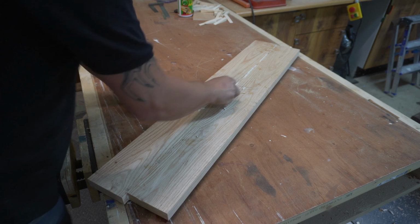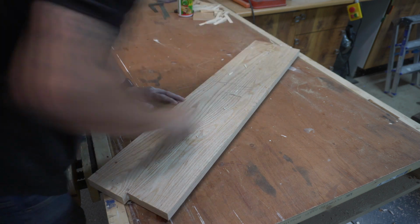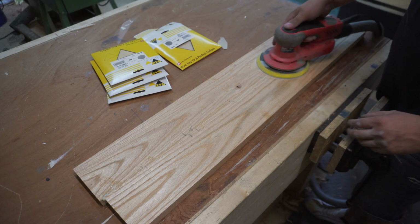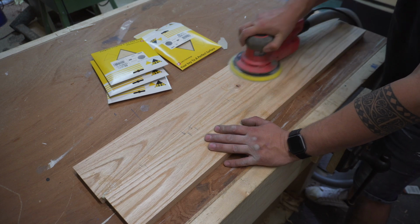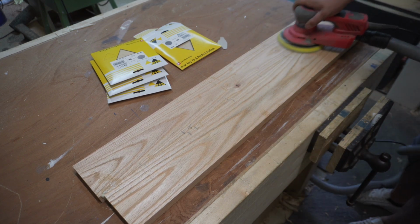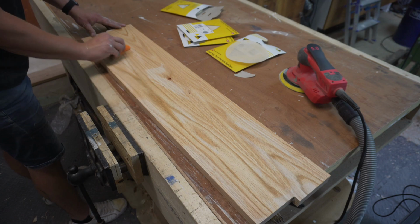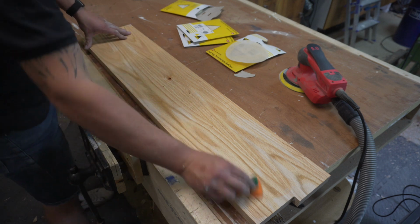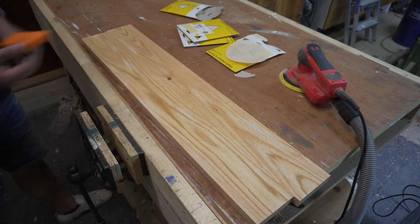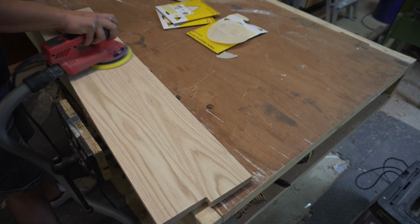Okay, so now we're out of the clamps, we can scrape the excess glue off. So we used a 5-minute polyurethane glue on this. I did wet one edge, but it still took about an hour to go off. I think they lie to you when they do this. But yeah, giving it a nice sand. We're starting with 80 grit here, and then we're going to wet it down in between the 80 grit and 240 grit I went down to, just to raise that grain, let that dry, and then we can come back again and give that a final sanding.